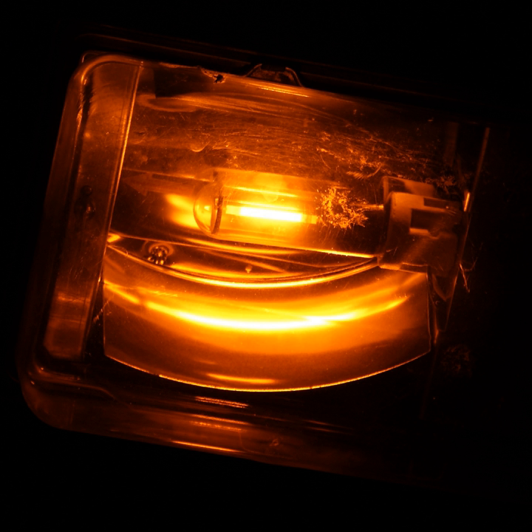Unlike HID lamps, during a voltage dip low-pressure sodium lamps return to full brightness rapidly. LPS lamps are available with power ratings from 10W up to 180W, though longer lamp lengths can suffer design and engineering problems. Modern LPS lamps have a service life of about 18,000 hours and do not decline in lumen output with age, though they do increase in energy consumption by about 10% towards end of life. This contrasts with mercury vapor HID lamps, which become dimmer towards the end of life to the point of being ineffective, while consuming undiminished electrical power.